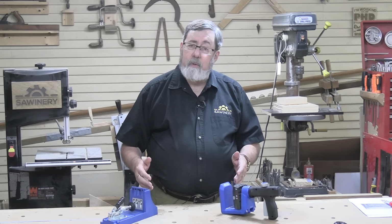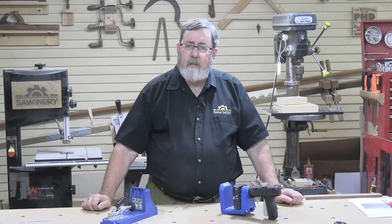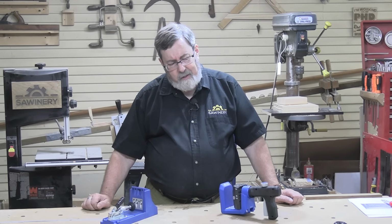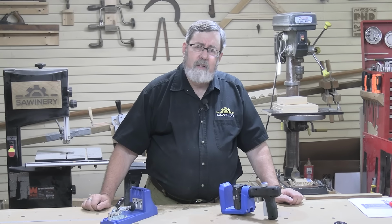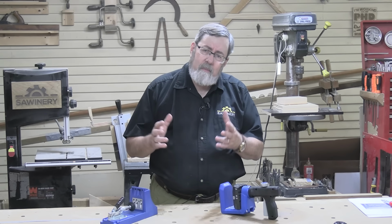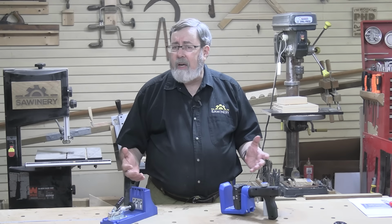I certainly wouldn't want to put that together with pocket holes and have somebody sitting there at a table wondering, what's that spot on that leg? Oh, it's a dowel rod where he hid the pocket hole. Why do you use pocket holes to put that together? You know, that's one of the limitations of pocket holes. You really can't hide it.